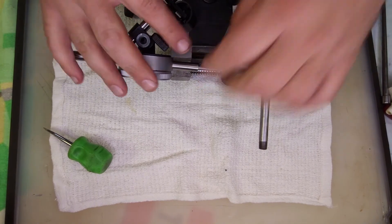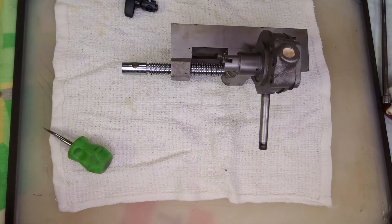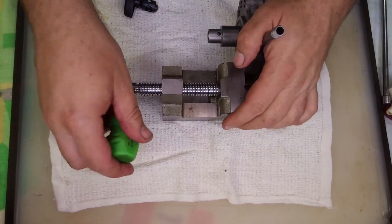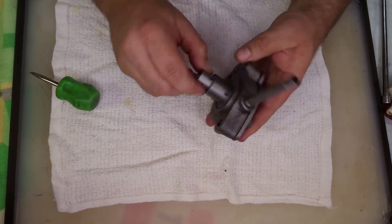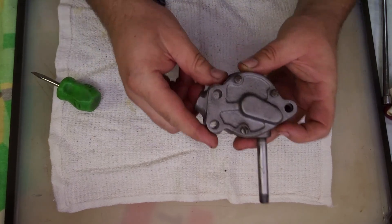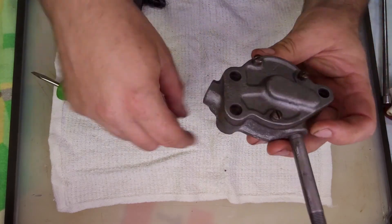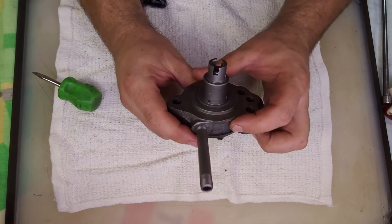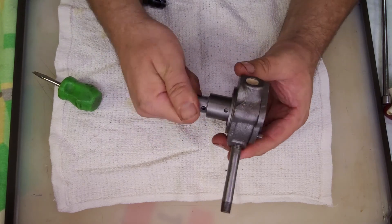I imagine this is a test that 90% of people building these pumps don't necessarily do — as long as it all looks good and not worn. So I'll get this thing cleaned up and painted, trim off the excess gasket since it wasn't quite the right size, punch out the gasket piece in the bolt holes, and I guess I'll pressure test it too. Should work pretty good.